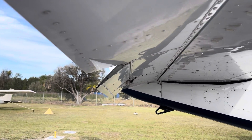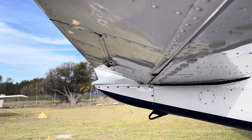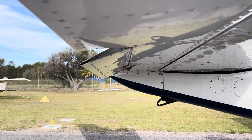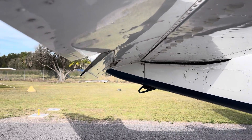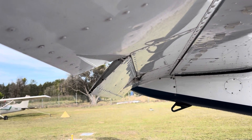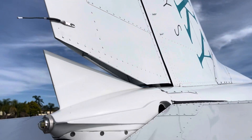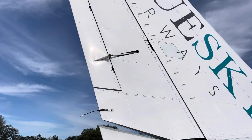A bit of a trick to double-check elevator trim in Chieftains. I always reset it to take-off after I've landed. I find that if you push it all the way up to full deflection of the elevator, that's where the trim tab will sit flush. So at level, it's got that little bit of what you would call back trim — elevator trim tab down. At full deflection sitting under the weight of gravity it looks about like that, but at least that way you can calibrate in your mind what the trim indicators are doing. Also on trims, I always make sure that the rudder trim is somewhat neutral, particularly if it's been doing training or come out of maintenance — just to make sure no one's accidentally left a trim at full deflection.